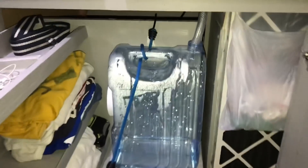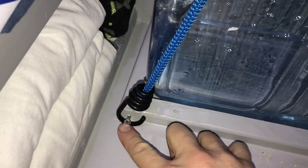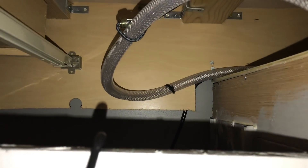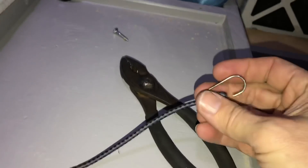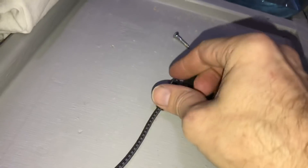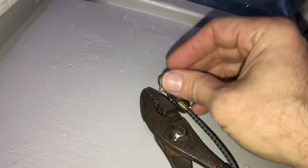The water tank is in place. I found I needed to bungee it down — not because it was moving but because of the pressure from this rigid pipe. I clipped it over the top and put a screw in so it's not coming off. I also zip tied the intake tube back on the wall so there's no pressure on the water pump line. For the bungee I took a small bungee cord with a clip, squeezed the clip small with pliers just to the size where a screw could fit through it.